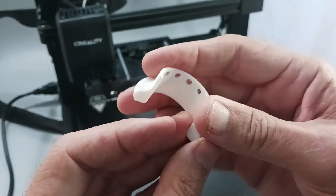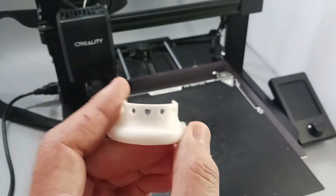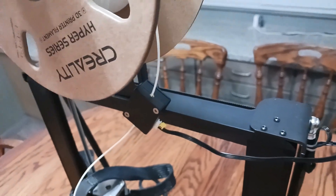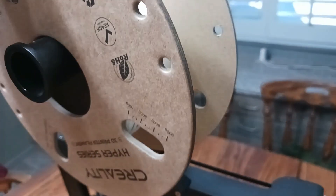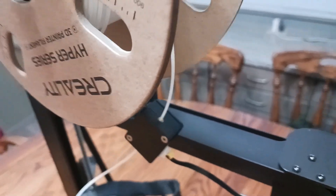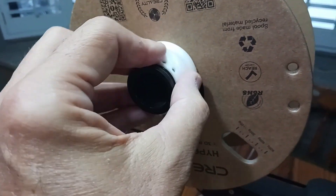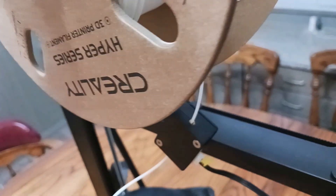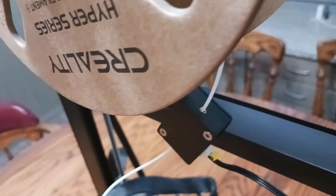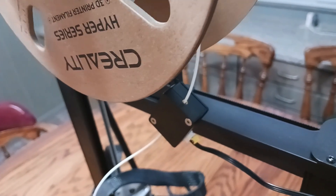And so there's my print. I'm going to go ahead and check to see if it fits on my spool, and that'll be my last upgrade. My main concern was that this wobble on that arm would cause some stress on the interrupter switch, so I'm hoping this would minimize it. It snaps on just really easily — look at that, it looks pretty good too. You can see it's eliminated a lot of that play in that spool, so hopefully that's going to help my interrupter switch. It was not a big deal to do — it was basically free, just a little bit of PLA material.